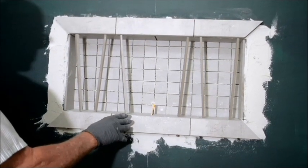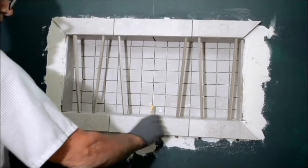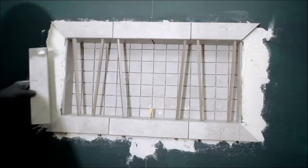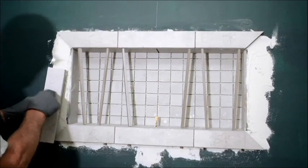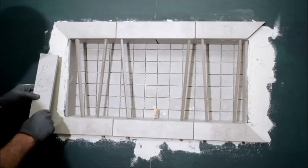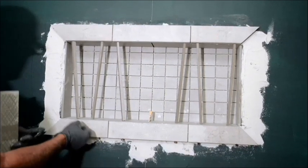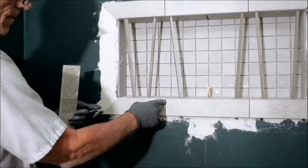My thing is always about symmetry. So my bullnose first goes across here, unless you had a longer piece. First goes across the center, and then the split difference gets over here. So I always do my corner cuts, my 45s, as you will, first, and then I figure out where my middle mark is, and I cut off this part here. So I'll figure out this is about 12 1/4, so about 6 inches up from there. I'm doing this cut first, as I did those two cuts first, and then I cut off any excess, so that I physically brought the piece in, and I went up to the corner edge where I know I'm going to be, and then I just cut off the excess.